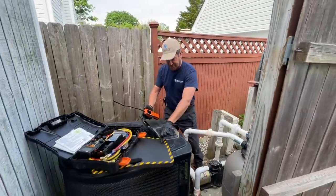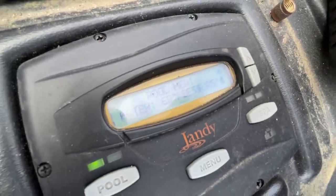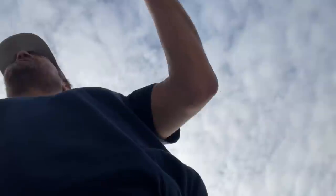This came on after a five-minute compressor delay. I haven't even hooked up the gauges yet, but here we go — fault, low ref pressure. Low refrigerant pressure. When I took the access panel off I immediately saw some oil residue around one of the service ports. There are two service ports: the high and low side. I got my electronic leak detector out and it picked up more of a presence on the low pressure side, but as soon as I took the cap off the high pressure side, oil is coming out of the Schrader core. A Schrader core is identical to a car tire valve — that's how we add refrigerant. It may be the only leak, but I'm going to recommend we take out both cores, replace them, and then leak test again.